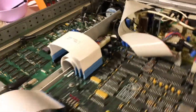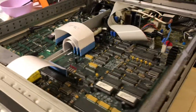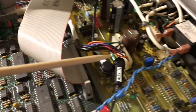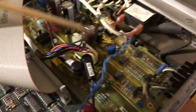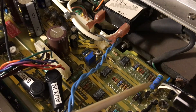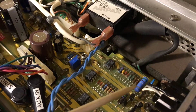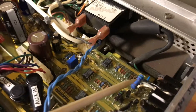The original problem with this unit — let's see if I can get in here — was this resistor. I could tell when I took the unit apart that it had been taken apart already; someone had tried to go in here and fix it. Long story short, this resistor right here in the plus 15 volt power supply section had failed, or I assume it had failed — it had been replaced.